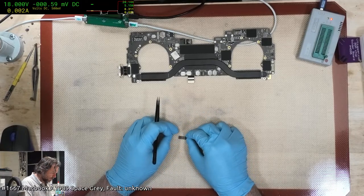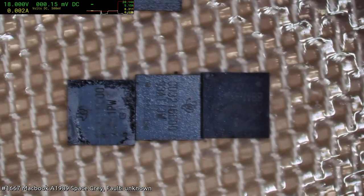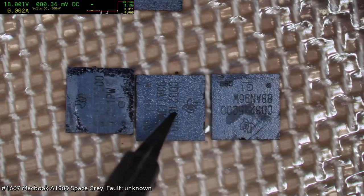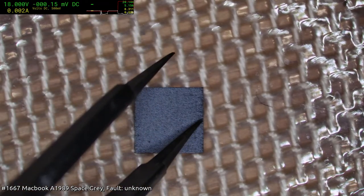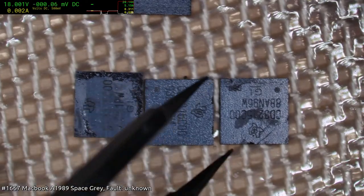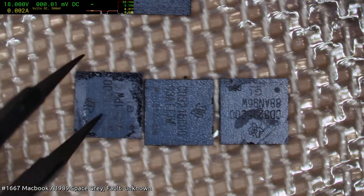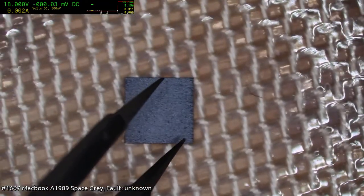So I've got three real chips here and one fake chip. You can see, as you bring the light over these ones, and these are completely different batches, you can still always see the laser engraving. But you go over this one and it's like, nope, not here. And you can see this pitting of this top surface along the edge here. That indicates that something has been cast over the top. While you do get similar effects, it just doesn't behave the same way. The top layer maintains its integrity. Even when you break it away like this, it doesn't start looking like this.